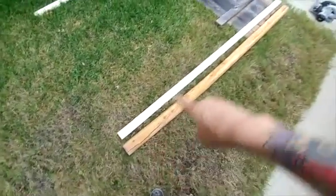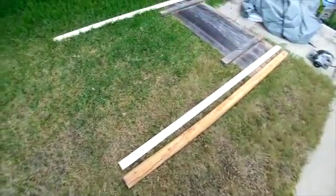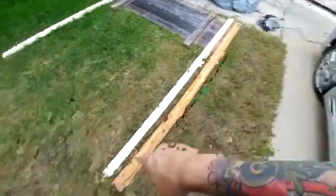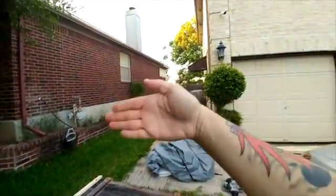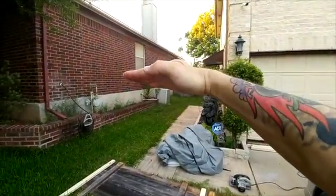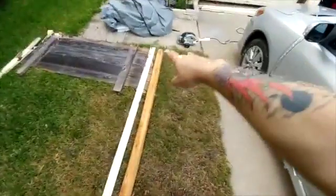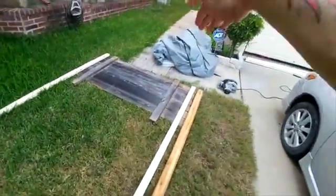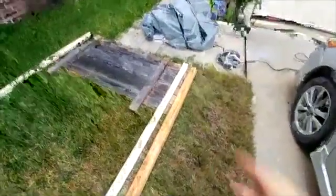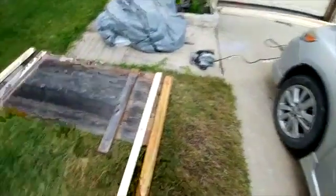What I want to do is figure out this back frame wall, and I'm going to cut these light boards. I'm going to cut them down because the wall will be here, and then the roof will go up. So I'm going to leave these 8 feet. So I'm going to cut this one down. That'll be the back wall, so it will slope down to the back wall. So I'm about to cut those two right now.